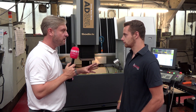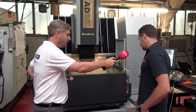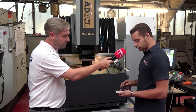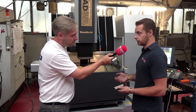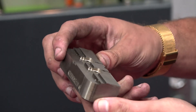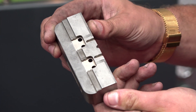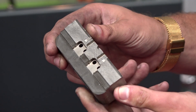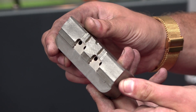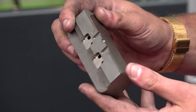You're obviously really happy with the machine itself — the speed and how it works. Let me show you what we've been manufacturing to prove how good it is. What I've got over here is a set of inserts which the customer required with a spark finish. You might be able to mill it, but it's the finish he desired, which meant we had to rough mill it and then spark it. With this sort of thing it's not too complex, but being able to spark it makes it very useful.